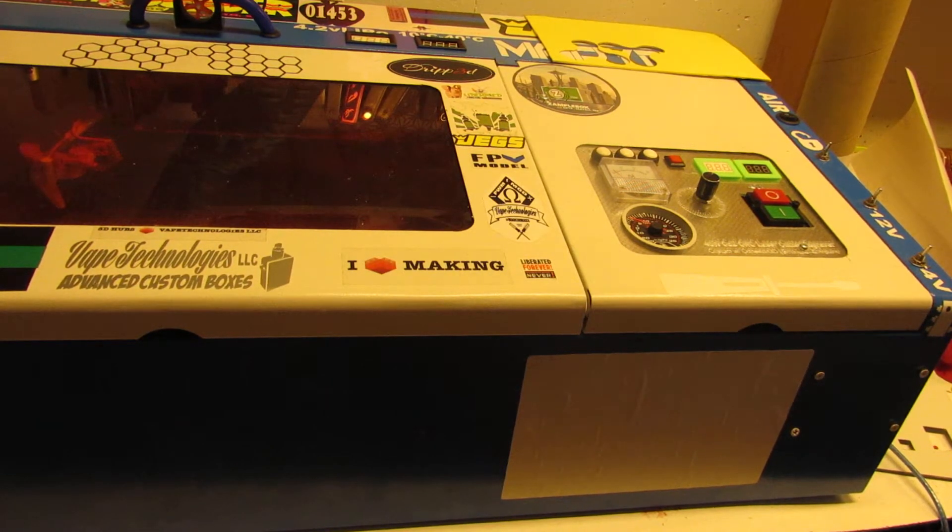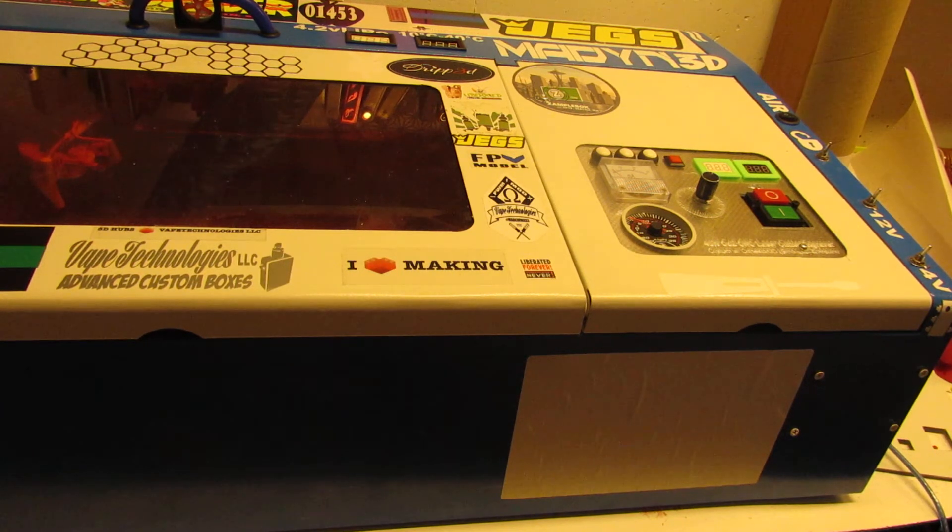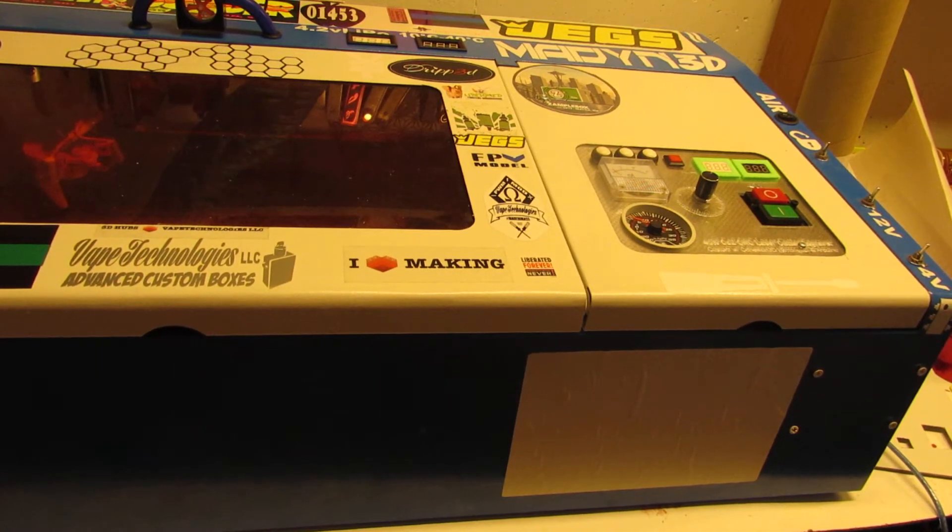Just gonna shoot a video documenting what's going on with the laser. I made a few videos before — had an issue with the power supply, bought a new PSU, switched it out, and everything's been great for a few months. Now we've got another problem: some arcing behind the PSU. At first you'd think, why is a brand new PSU arcing? Based on my research and troubleshooting so far, I actually think it's a bad tube.